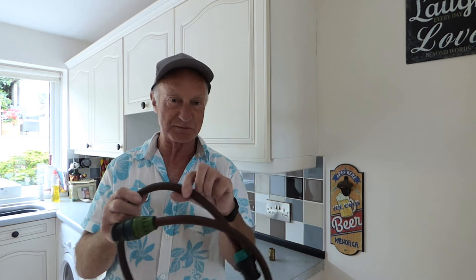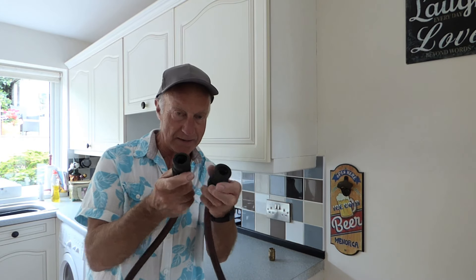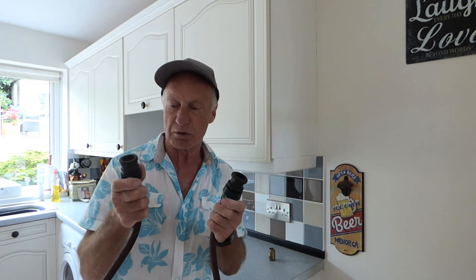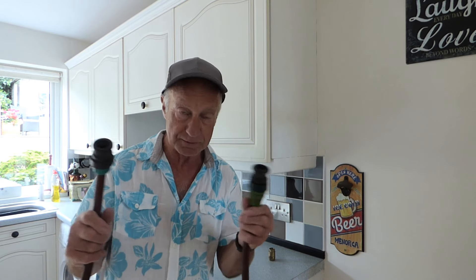This is one of the things I use — I'll make this up special with this bit of hose. As you can see it's got two adapters on it, you can get them anywhere. If you've got two separate taps, hot and cold, you've got no problem. Make the sink up like this with a short bit of hosepipe: put it on the hot one, put it on the cold one, open the hot tap — there'll be nothing coming out anyway — then open your cold mains. The mains will blow up the hose and up into the hot. Let it run for about 10–15 seconds, you'll probably hear the air go, then shut the cold off and pull the hose back off. The hot will run once again.